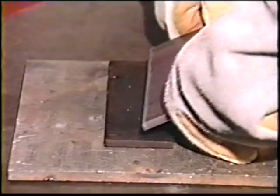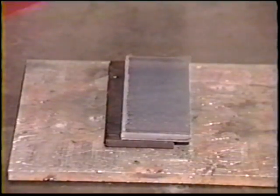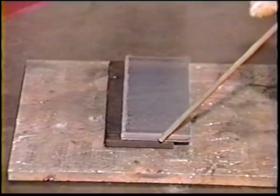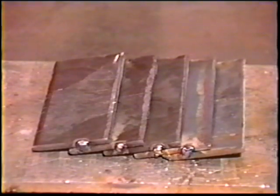Position the plates to form a lap joint at about the middle. Hold them firmly together and strike an arc at the end of the joint. Make short welds called tack welds on each end of the joint to hold it together and in alignment while welding. Thoroughly clean the slag. Add three additional pieces and tack welds in the same manner to form four lap joints.